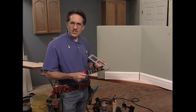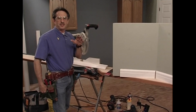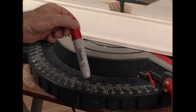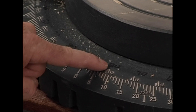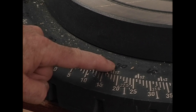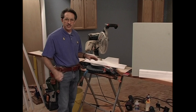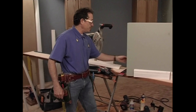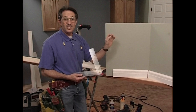A 90-degree corner looks just like this, and a 45 looks like this, and a 22 and a half angle is even sharper. A 22 and a half is so acute that we rarely work with one unless we're casing a trapezoid or triangular window, cutting a scotia miter between the baseboard and skirt board, installing crown in an octagon coffered ceiling, or installing baseboard on a wall that's as sharp as a knife. I like this protractor a lot — the gauge is easy to read, it's a durable tool. I just wish it had normal protractor angles on it. Just go over to your miter saw right now, take a Sharpie, and right where it says 0, write down 90. Where it says 10, write 80. Where it says 20, write 70 — just like I've done on my saw here. Those are the real numbers. When you look at a corner like this, you'll immediately think 135 degrees, 67 and a half miter, and you'll be on the right track to making miters the easy way.